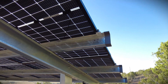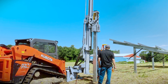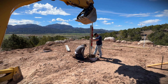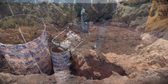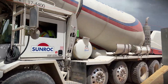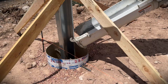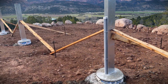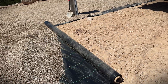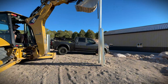I could always mirror that on the west side and add two more panels if we wanted to expand. Now in areas of softer soil you can just pound these straight into the ground, but our site was different. This terrace was built from the barn excavation material — it's full of boulders and uncompacted fill — so instead I dug larger holes to pull out all the boulders and then used sono tubes to pour the concrete. I went extra deep on the footings: five posts, five footings, two feet wide by eight feet deep, to give me confidence that this array won't settle, tilt, or shift in the 60 to 70 mile-an-hour winds we get out here in southern Utah.